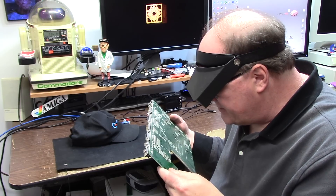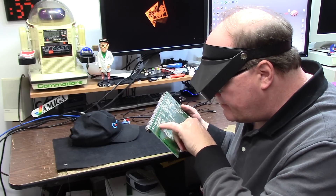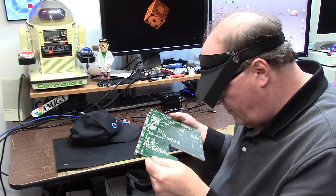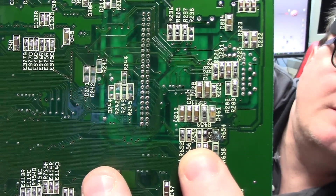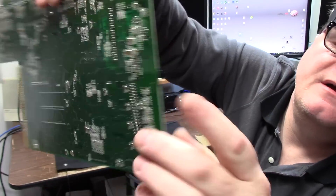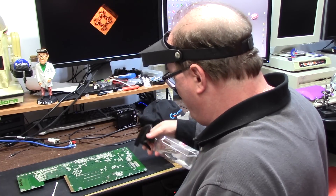Then we'll take a look at the resistors and the ferrites over here, then the caps — they're ceramics. Floppy ceramic looks okay. I'll have to do some resistance values and continuity testing on these ferrite beads — sometimes they crack and you don't know it. Looks like this one's been replaced once or twice. That's why your stuff's not working — look at that! BAM! Somebody burnt the living crap out of the bottom of the freaking transistor network right underneath here. Yeah, that got smoked big time.